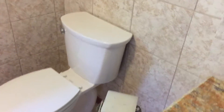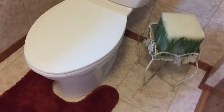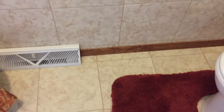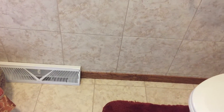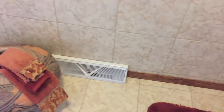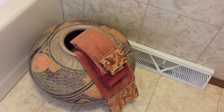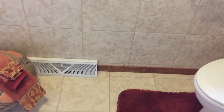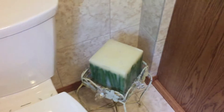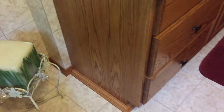Got your bull nose on top around the perimeter of the room with the tile. A lot of people will put the wood trim on first and tile down to it. We left a gap between the tile and the floor, put a wood spacer back there so we can nail, and then put our wood trim on top of the tile. So if you ever want a different wood trim or want to change it, you can — you're not locked in.